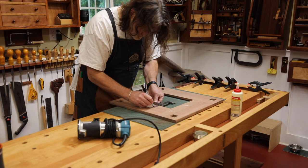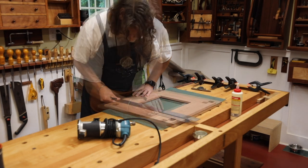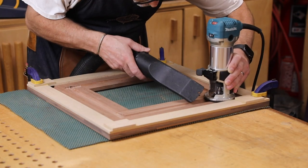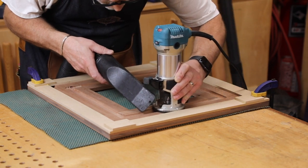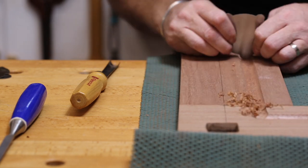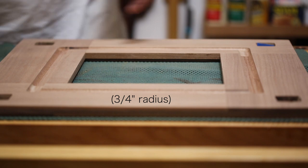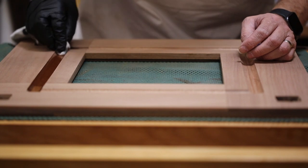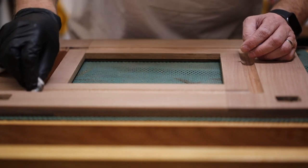Instead of just surface mounting the strip lights on the underside of this top, I'm going to cut a channel and then mount them inside that channel. I used a core box bit to route out this channel, and with the radiuses — I think it's a quarter inch radius on that — I even thought about painting it with silver paint or something to make it a big reflector, but then again I thought that was kind of overdoing it.